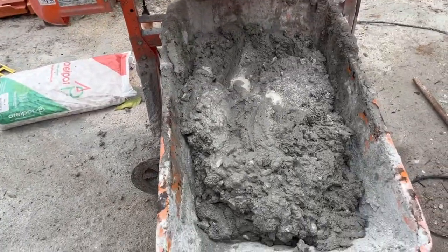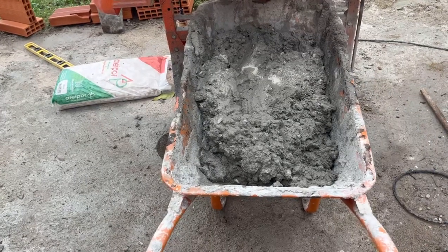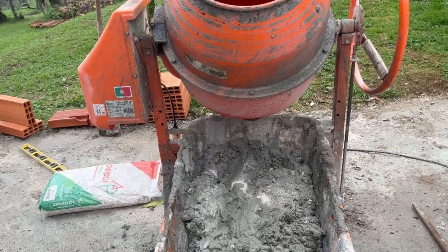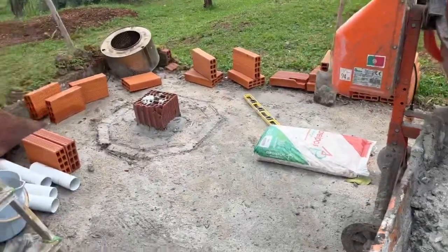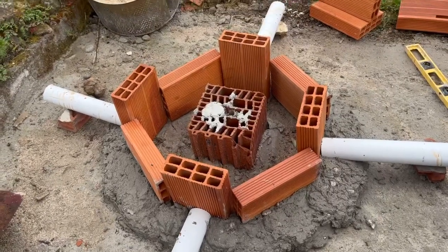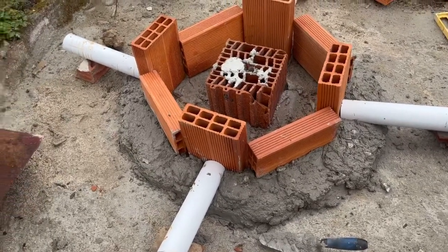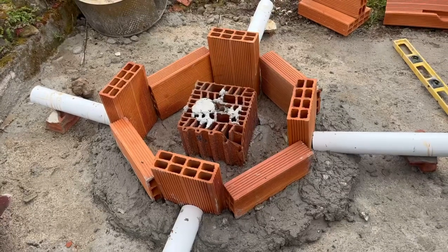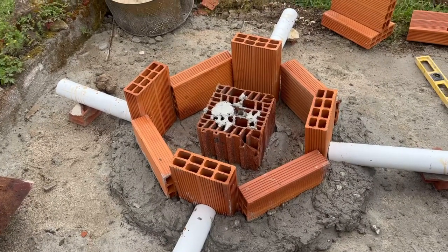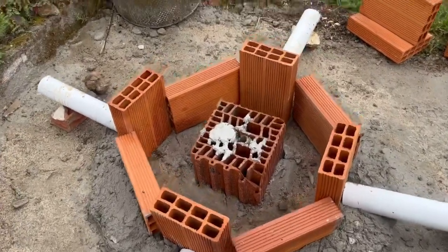It's a chunky mix of stone and cement — two bags of ready-mix mortar and one bag of stones, about 75 kilograms of concrete. There's a little left over but I'll leave that wet just in case I need some at the end. I've lined the bricks up to give the inner circle, using them to stack up the concrete alongside with the tubes in, then build it up another layer and let it set. I'll pull all the bricks and pipes out as it's setting — that happens to be the right size.